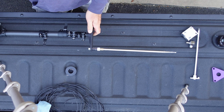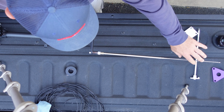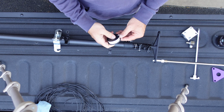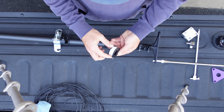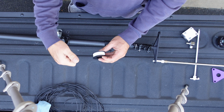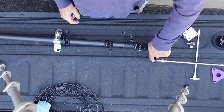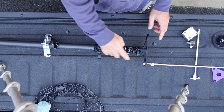Now that's all good and well. We have an antenna that will adjust up to 2.5 meters on top of the Gigadoo, but that doesn't rectify what we're going to do with the 25 feet of silicone wire. The theory is pretty simple. I'm going to take the end of the silicone wire, solder it into a ring connector or some sort of connector, and then attach it to the bottom portion of the Gigadoo topper. Then we'll run it down.